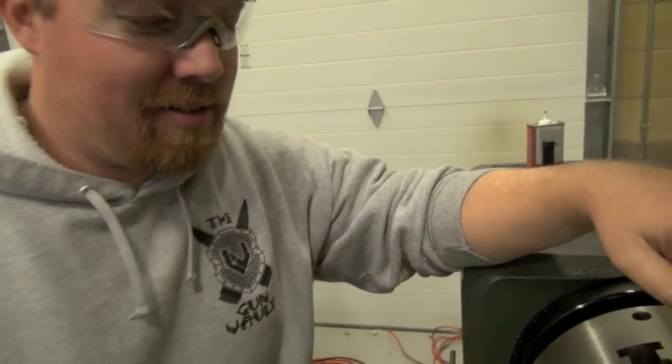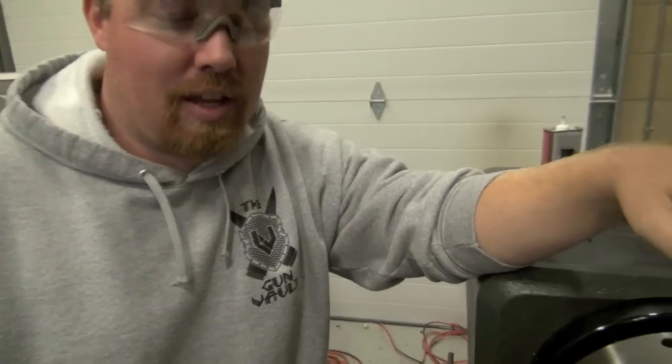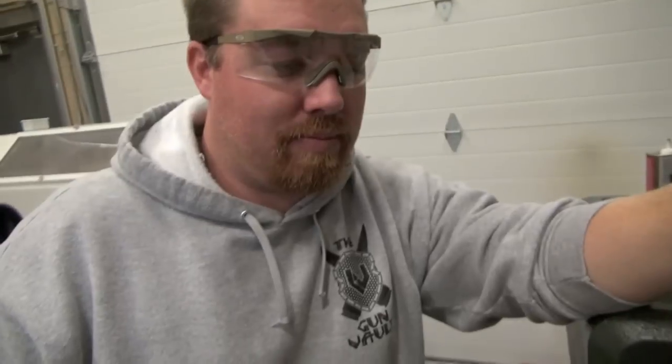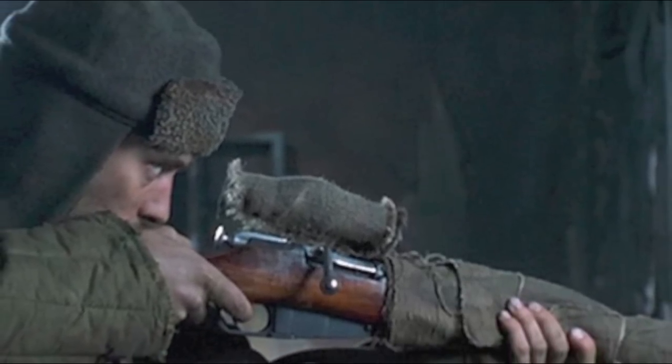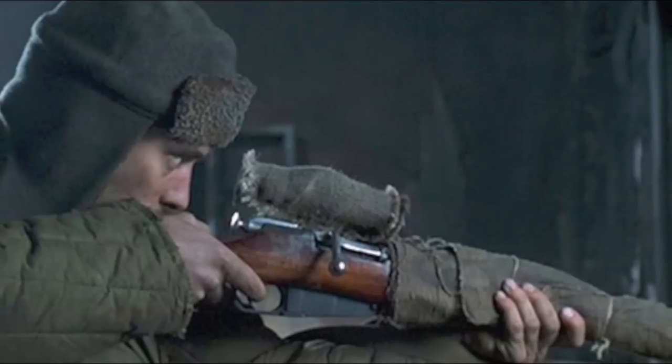So we always tell guys when you mean out around that the barrel itself inside the bore is great, but the outside diameter is kind of messed up. Yeah, we've seen some Mosin Nagants. They are so far out we can't even thread them. We've had a couple, you know, two or three. Usually we'll be able to dial them in. But they have an excuse, man. They're getting bombed by the Nazis in 1940. They're putting a gun together by candlelight. They did pretty good. You know, this one's got no excuse.